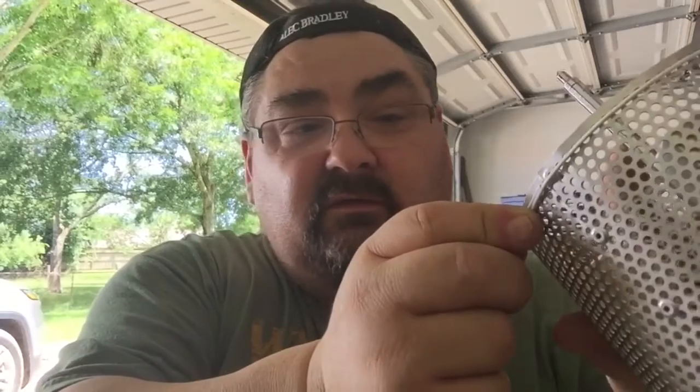I'm using my wire circumference technique to give me my diameter. So if my math skills do not fail me, I believe circumference divided by pi will give me my diameter. I think it's diameter because the circumference is pi times diameter. Well, you're learning a lot of math on my channel, aren't you? Let me get it measured. My memory served me well — circumference divided by pi is diameter. It was just over 5 inches, and that's what I got. It's a 5 inch diameter drum.